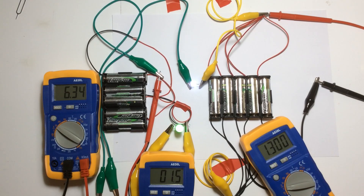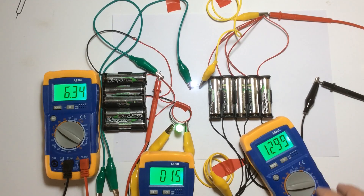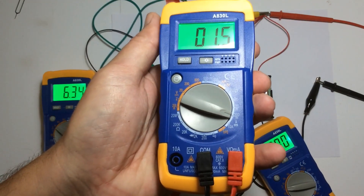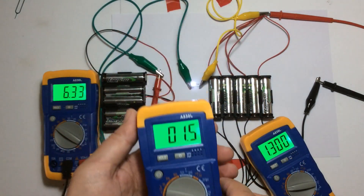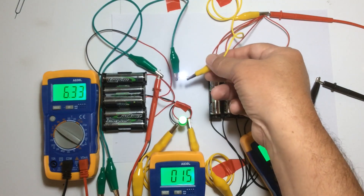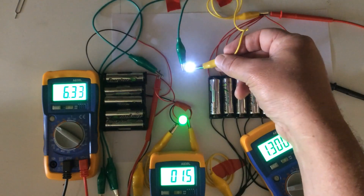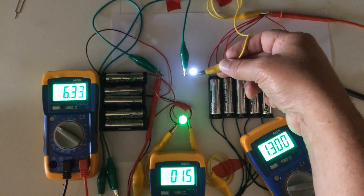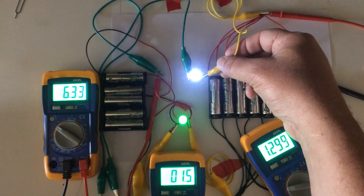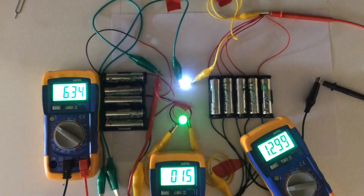We are still on the same amp setting — that's on the 200, 200 mA — and we are now down to 1.5 mA. The light is still considerably bright; if we switch that off again it's blindingly bright. You know, on the correct angle — all these LEDs are like that, you've got to be directly head-on for maximum illumination.